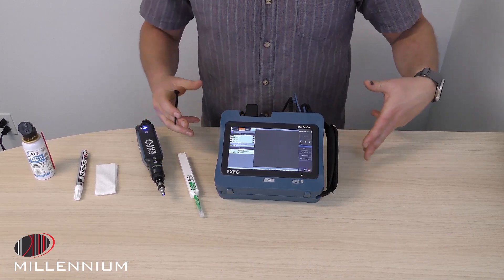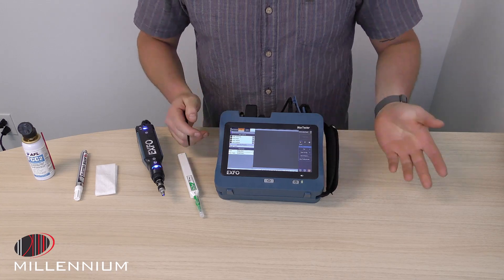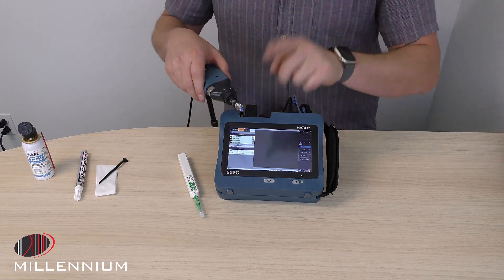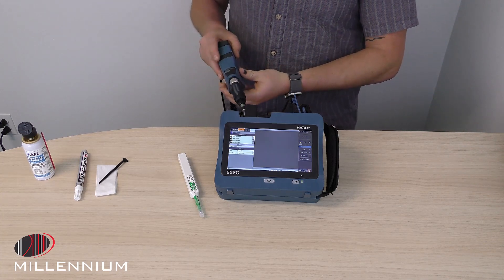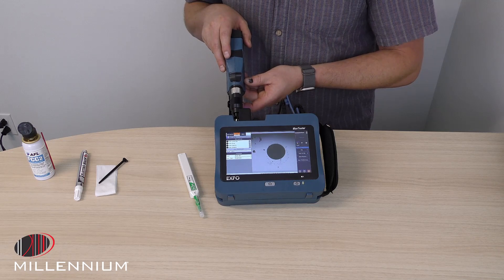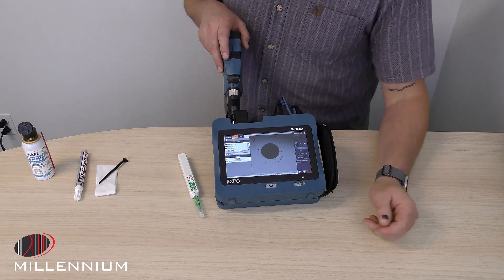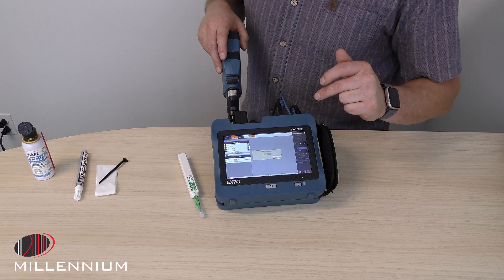Now I gave you an overview on how to clean — let's get down to the brass tacks. We've got an OTDR here that just came back from rental. Let's check out its port. When I plug in my inspection probe, make sure you swap out your tips based on whether it's APC, UPC, or if it's a bulkhead or a jumper. Pro tip: to reduce the number of connectors you need, use a bulkhead adapter. Let's start inspecting this connector.